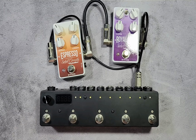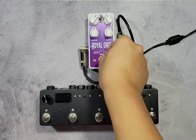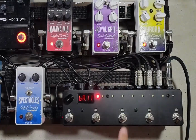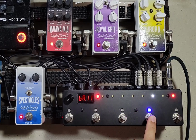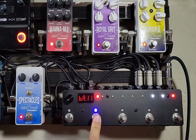7 pedals. After connecting all the pedals to the unit, and managing power distribution, make sure to enable all the pedals in the loops, and leave them turned on all the time. The PedalBot itself will decide which pedals will be inside the signal chain, and will remove loops that are not enabled, based on the switch assignments.